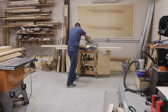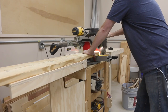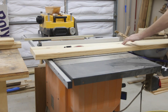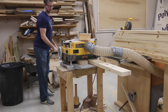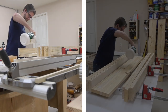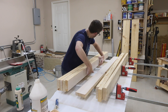There's a lot of milling that happens in this video. I'm starting with that here. These are two by tens and you can find them pretty much anywhere. I'm just cutting them to the rough length for the workbench top pieces and then I'm ripping them in half. Then I glue them up in sections being careful not to have any knots showing on one of the sides — that will become the top side.